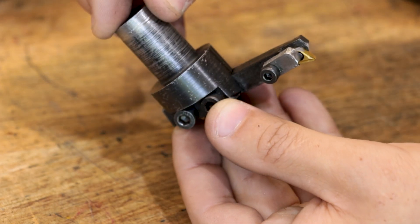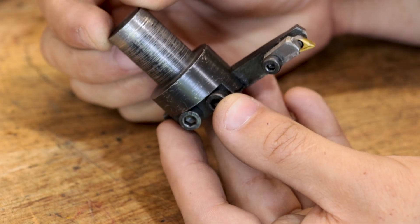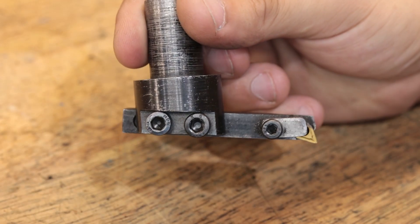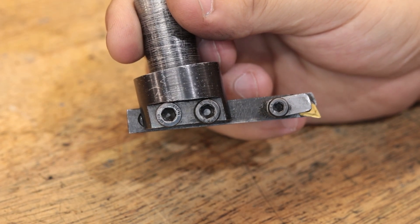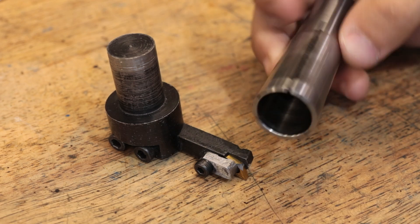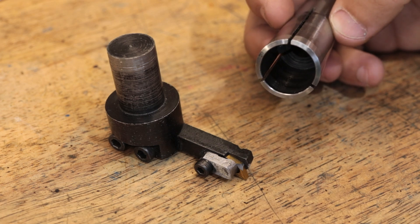And that brings us back to this tool. There isn't anything wrong with it in particular, but there are a few things that I've been meaning to improve. For one, the protective coating is starting to peel off, and it can stand to have a bit more mass added to the main body. But mostly, it needs a bigger shank. I switched over to using 20mm collets as part of the quick change tool system, and the old shank simply doesn't fit the new tooling.